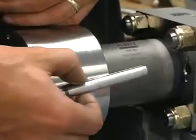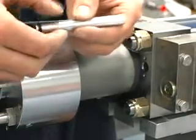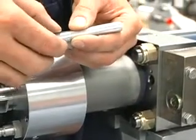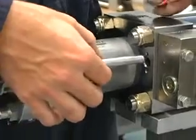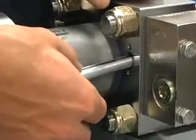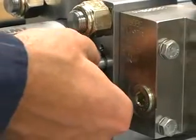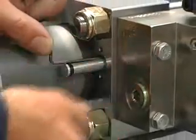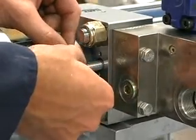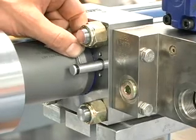So what we do: this is going to go in the hole, and then we're going to turn this while holding a little bit of pressure inward on the Allen key until we find the hole in the end bell, and then we'll push it all the way in. Keep it upright so it doesn't fall out, push it all the way in, hold a little pressure on the Allen key and turn it. Now it went in and it's all the way into the end bell.